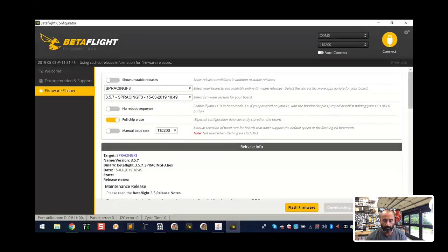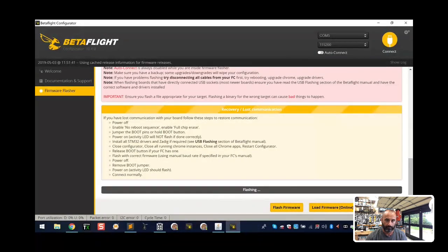Click 'Load Firmware' and then click 'Flash Firmware.' Sometimes my clicks don't register, so bear with me. There we go - we're going to watch it flash. Now sometimes when you try to flash firmware, depending on your computer and drivers, you may see a disconnect but not a reconnect to the board. Just unplug your USB and plug it back in - that may get you back into DFU mode so you can flash it. I do have that problem on some boards. You'll hear it disconnect with that Windows chime and it tries to restart in bootloader mode but never comes back up - your COM port never fills back in the top right. Just unplug and replug your USB, then click flash firmware again without starting the whole process over.